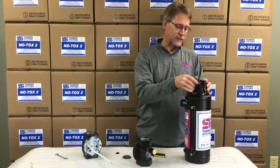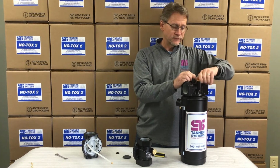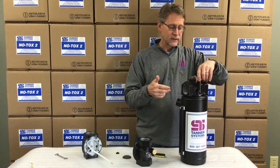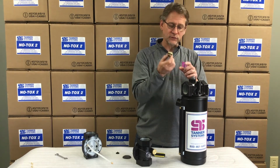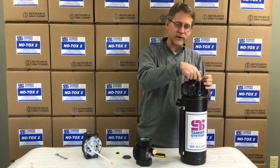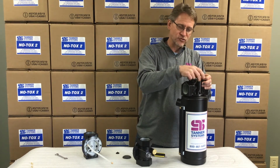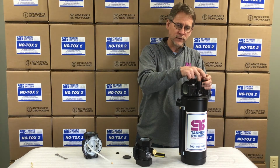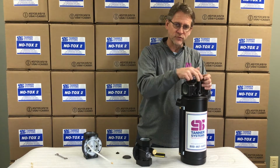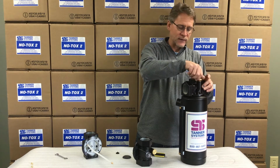the last thing we can probably look at is underneath the fill plug. Again, on this dispenser, it's this brass fill plug. On the smaller ones, the T85, the T83, and the T89 or the T90, it's a plastic fill plug that's a little smaller than this. This plug, when it is fully seated, pushes down on a check valve. So reach down in here and push on that check valve to make sure that it is popping up and down. Your Schrader valve is just like the one inside your valve stem in your car. Make sure that Schrader valve is working properly. If it is either stuck open or stuck closed, replace the Schrader valve, reinstall your fill plug. You might be back in operation.